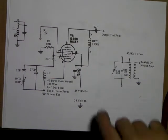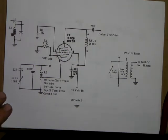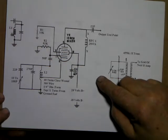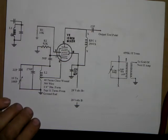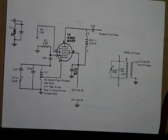I was looking at the tube that it used in there, and it uses a 26D6. That's a 26 Delta 6. So I went and looked up a 26D6 just to see what it was, if there was anything close to it. In the data sheet, it said that all curves follow for a 6BE6. So me having 12 volts right here at my disposal, I got a bus bar in here, it goes right out to a 12 volt battery, I chose to go ahead and use a 12BE6 and check this little guy out to see if it'd work.